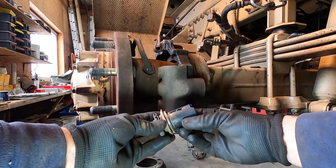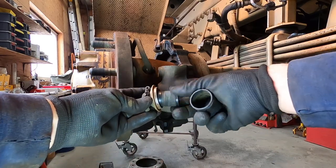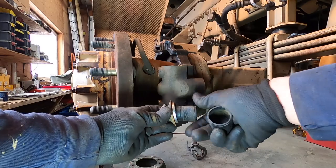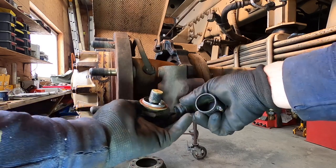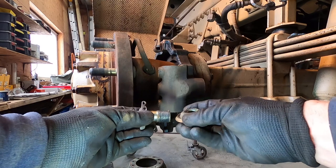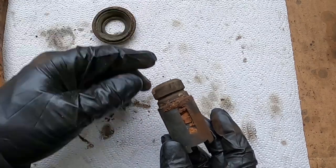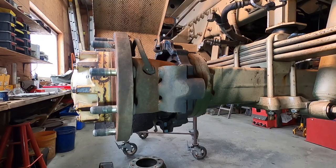This one's a little different because it's the adjusting one. This is the adjuster part. As the brakes move in and out, with this little peg that goes into this slot, it self-adjusts. We're going to clean all this up. This one is sealed — you can pull it down after you get that threaded out. It's a little different, smaller than the one for the other end. Here's how dried up that grease is — those are all the parts that come out of there.